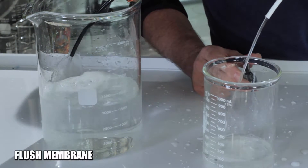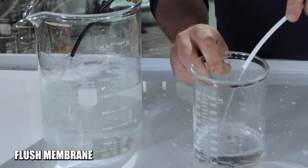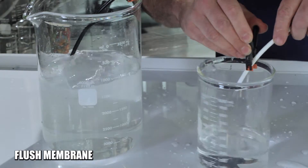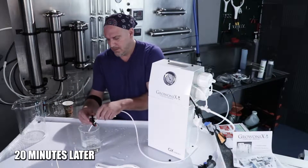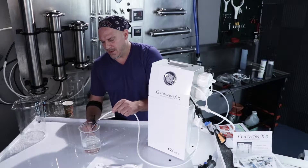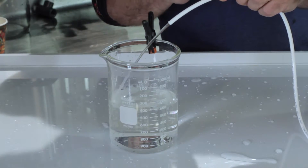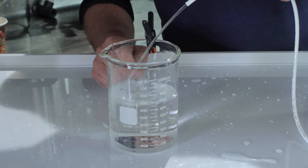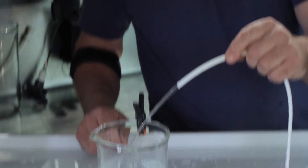We can see we're already making a lot of RO water and it's a little cloudy too. We're going to let this run for about 20 gallons and flush it out. Now we're in normal RO production and you want to run this for about another 20 gallons of water, or about a half an hour, to purge all the air out of the RO side of the membrane. Right now we're pretty clean — you can see there's not many air bubbles at all in the permeate stream, and we're flowing 400 gallons a day of pure RO filtered water.